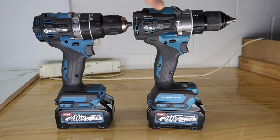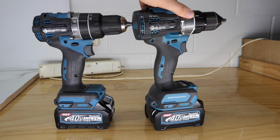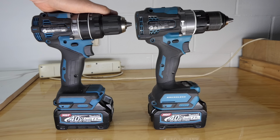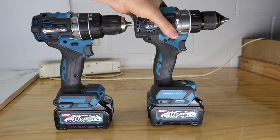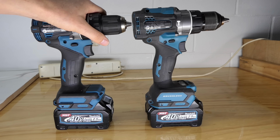Yeah, okay, I would not want to be using a 20mm drill bit trying to get into masonry or concrete with one of these. I would far rather use a rotary hammer drill. I tend to only use these hammer drills or combi drills if you're in the UK for 5mm stuff and stuff like that. 5-6mm, anything above that, I jump up to a rotary hammer drill because I don't want to be there all day and I don't want my poor elbow to be shaken to bits.